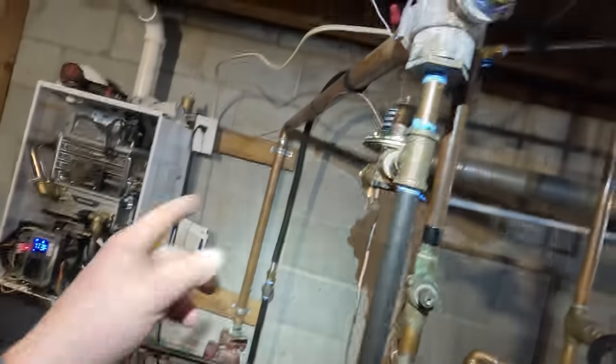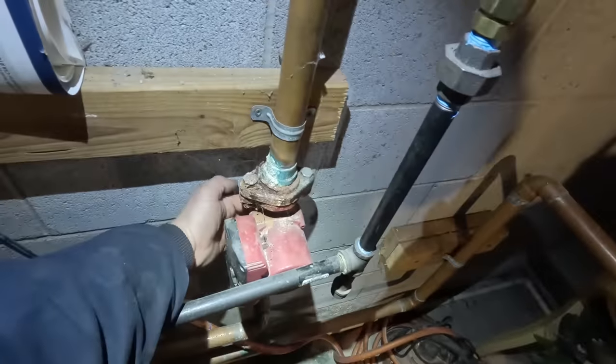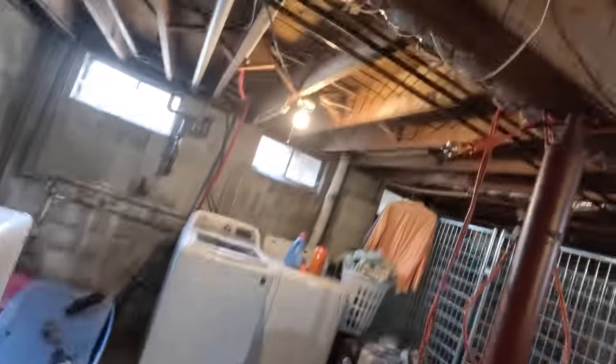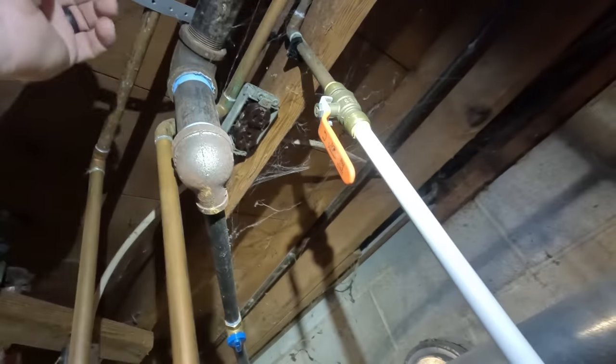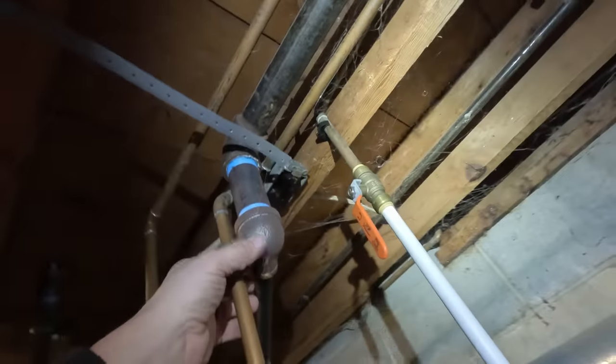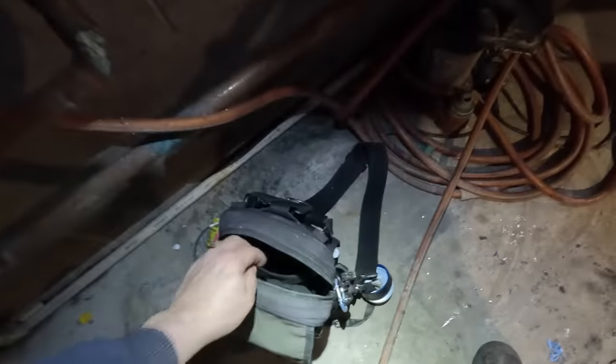Let's lock that up and start seeing if the valves are coming back hot. The pump is sucking it in there and pushing out through here, going out to all the different piping arrangements and splitting, with each return coming back hot. Got a little rattle here because a strap broke — I'll wire tie it to keep it away. It's not the way I'd rather see it, but at this point I'm going to get the system running before jumping for parts.